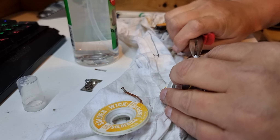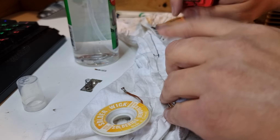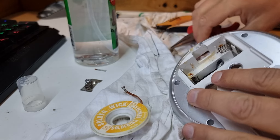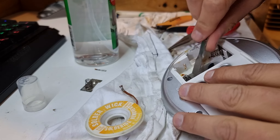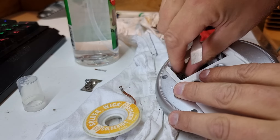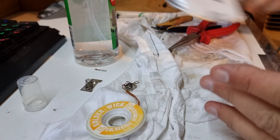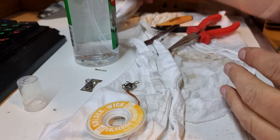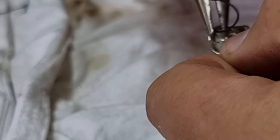Hopefully we can get this out without burning my fingers. There should be enough solder off there to get the contact out. You'll be able to give it a gentle push or a wriggle — grip with a pair of pliers, a bit of a wriggle, and it should start to push down.